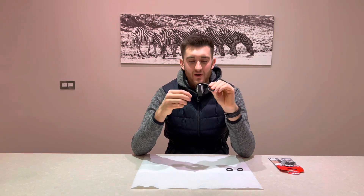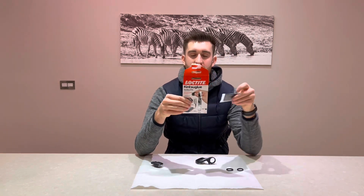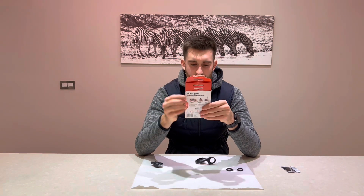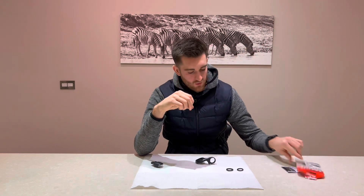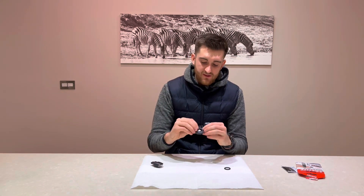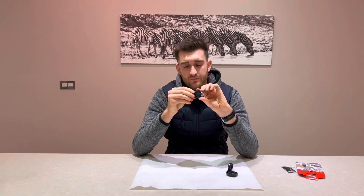It's very strong - you can't really throw it off, it takes a lot. But it does spin around the central point really easily rather than just sliding back and forwards, and that's what I want to solve next. I've got two rubber grommets. I also bought this Loctite kintsu glue - it's like a putty that almost hardens but stays fairly soft. I'm going to glue one rubber grommet onto the base inside around the magnet, and the other rubber grommet around the plastic ring here, to create friction and stop it from spinning so easily.